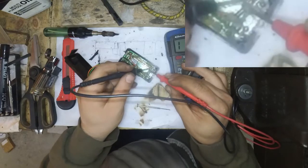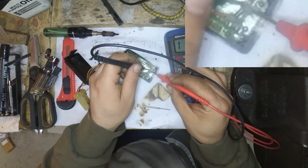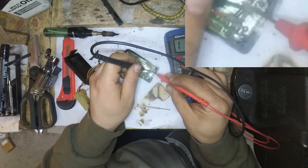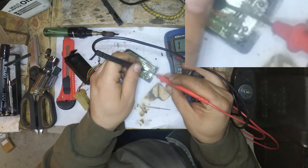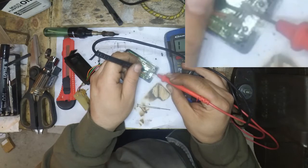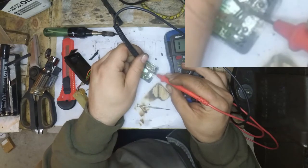It's possible that this resistor is just broken — that the resistor may be fine, but just the connection to the blob of solder is corroded through. And the other side, I can't get any connection either — not even through the solder.